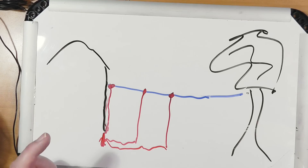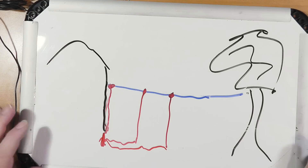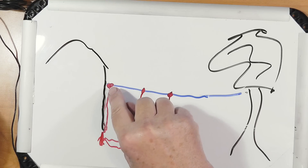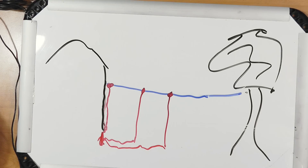You can take this down to your ground, your station single-point ground. End-fed antennas often require counterpoises — that's just a piece of wire attached that you can experiment with for length; it gives the antenna something to work against. They are capacitive in nature and can affect the tuning. MyAntennas uses a piece of the braid on the cable between the end of the dipole and the ground as the counterpoise, and it works. Mine was 50 feet — I have a piece of cable connected to my lightning arrestor assembly that is 50 feet long that I use for all the different antennas I test.